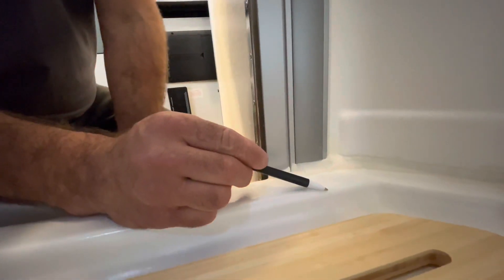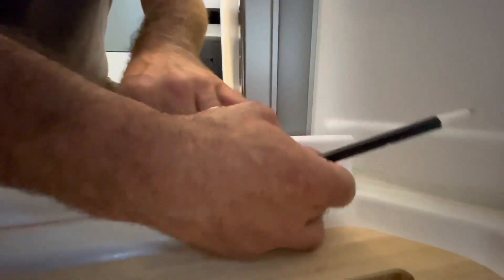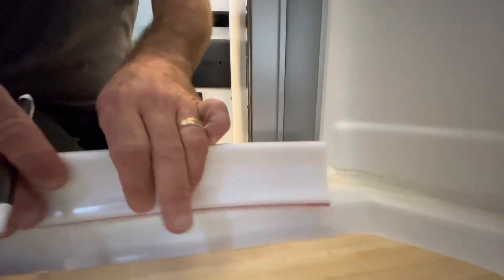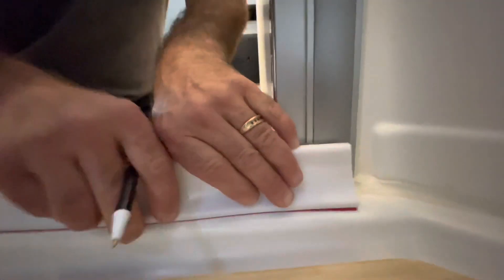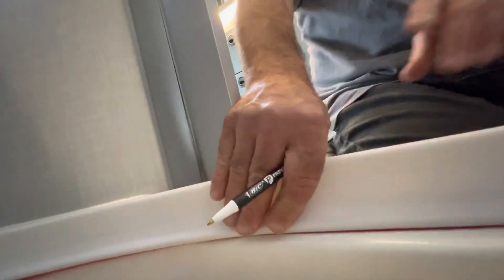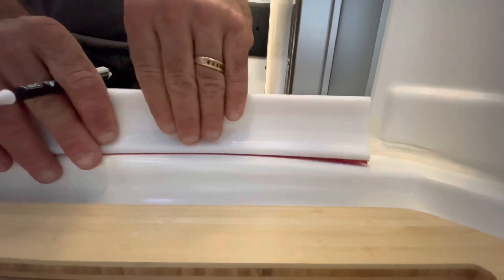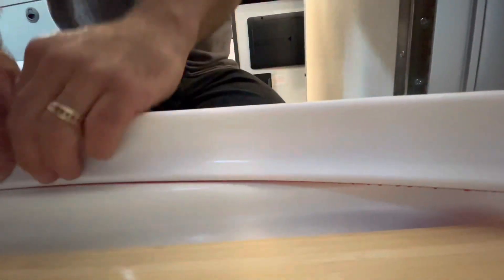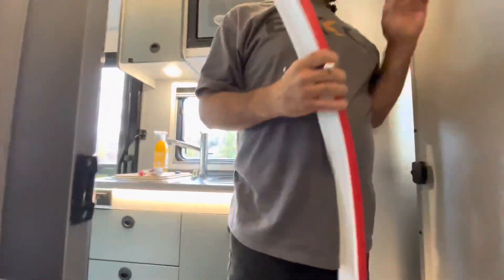If we push too far back it gets difficult for the product to adhere, so I'm going to start just slightly past where the door hinge is - at the aluminum track of the wall - and hold it there, guiding it all the way around. I lock it down with my other hand and follow sequence by keeping pressure. Then I go just slightly past the opposite wall and make a mark right there. Then we take it out and prep it to cut.